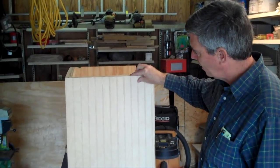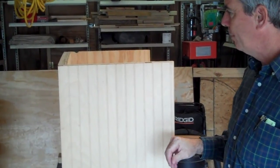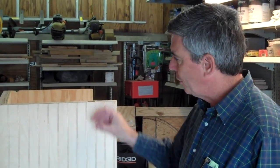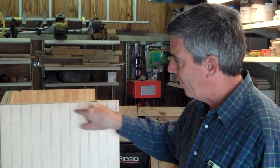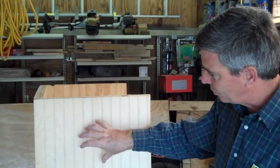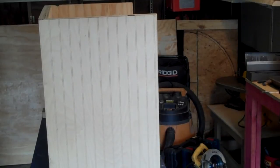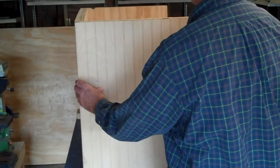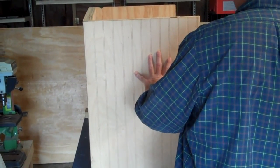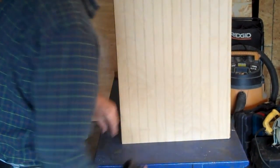It's now time to attach the paneling to hide the plywood. You have a bunch of different options — you can glue it, or just tack it with some brads. You could also put one-by-fours and nail that so it won't fall off, or put the one-by-fours around it, cut the panel smaller, stick it in, and have the molding hold it in. There are a bunch of different ways to do it, but this is the way I'm going to do it.